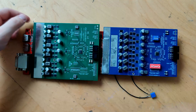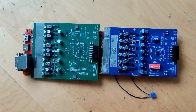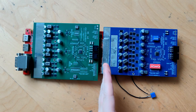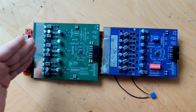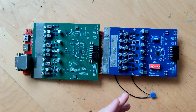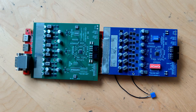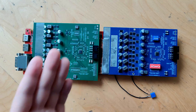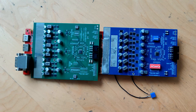Another change I really like is that you now have vCore and ground on both sides of the ePower. On the B2 there's just vCore on the front and just ground on the back. Whereas on the B3 you get both on both sides. This is useful because sometimes a graphics card has the VRM on the left side instead of the right, and without power strips on each side you'd be forced to mount the ePower upside down, making cooling the MOSFETs very difficult. By including strips on both sides, you just use whichever one applies.